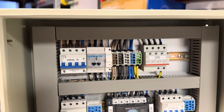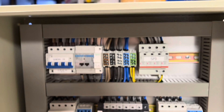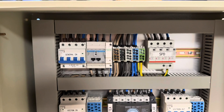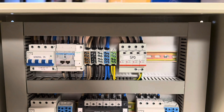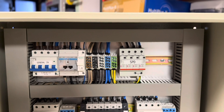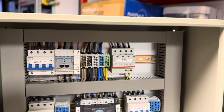With the smart meter we measure how much energy is going out and how much you're importing from the grid, giving us real-time measurements. This is protected by a fuse from Schneider. In the middle you find color-coded distribution blocks for the three-phase system — three phases, one neutral, and one protection. On the right side we have an SPD for AC-side protection, so the whole system is protected from AC issues.